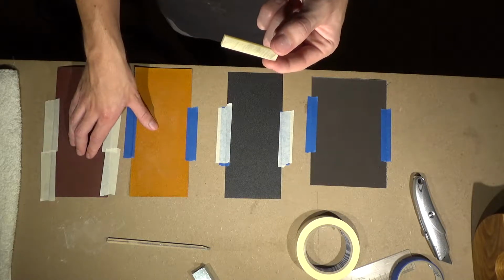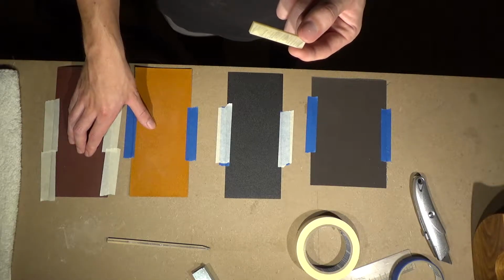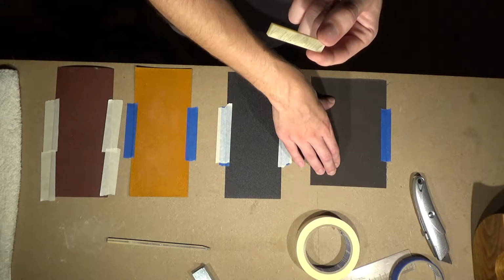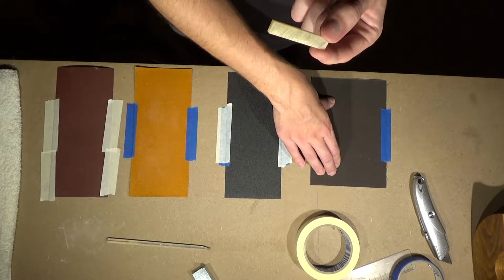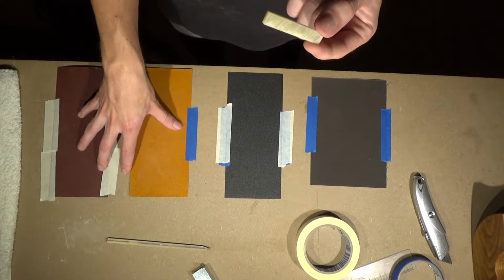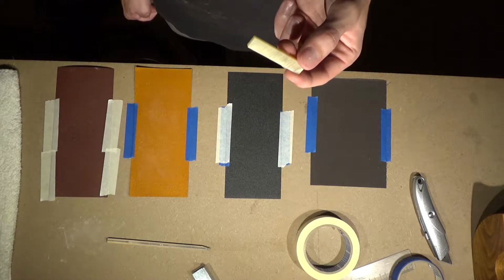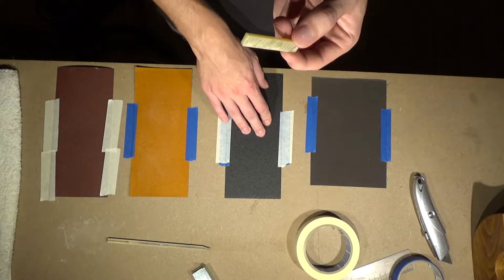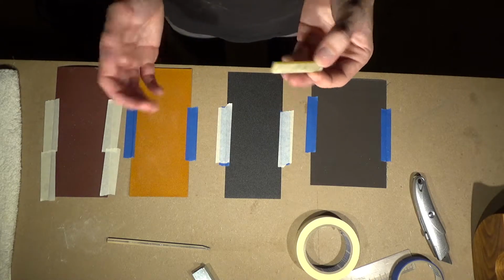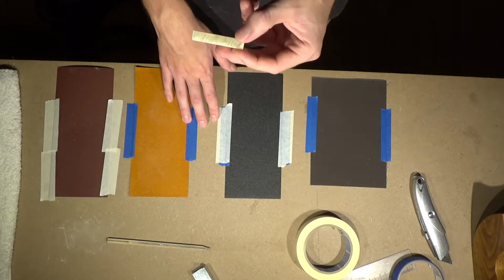So you get the thickness down by using a coarser grit of sandpaper, then move up to 240 and then 320. They will take off less material than the coarser grit over here, so you can keep up with your steps and you do not run the risk of taking off too much material. So you just have to keep an eye on it. But this right here is, you know, quite a good combo, so I would recommend doing it like this.